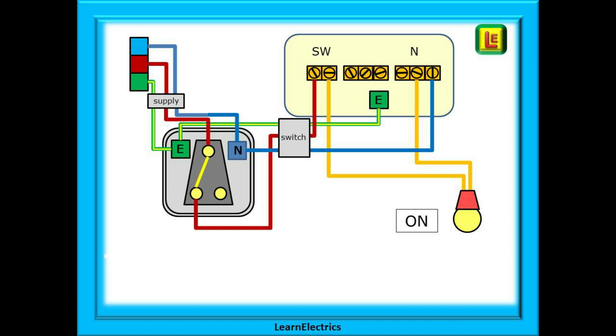A yellow pendant wire leaves the switch block and goes to the lamp, through the lamp and back along the second pendant wire to the neutral block in the ceiling rose. From the neutral block the voltage travels along the neutral wire back to the neutral connections in the switch, then back out of the switch up the twin and earth cable to the neutral of the consumer unit. If all that electrical path is intact and continuous, then the lamp will light up. And that is one-way switching in a two plate circuit.